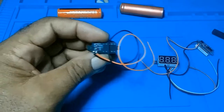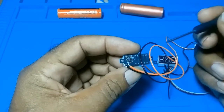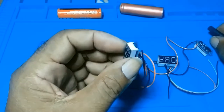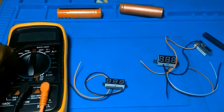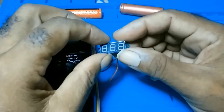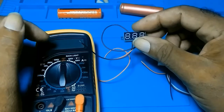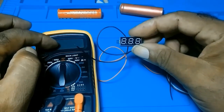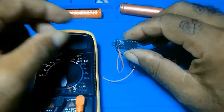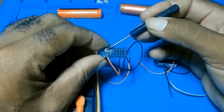Now, these meters with that calibration screw, you would have a multi-purpose meter. And you would connect your meter to either a battery or a power supply and watch the digits on your meter and the digits on your multi-purpose meter. And if they are pretty close, well, all well and good. But if you find it's far, then you turn this screw here to get your calibration where you want it.